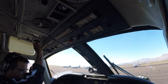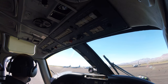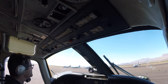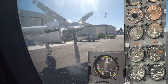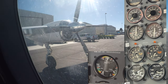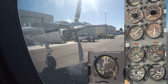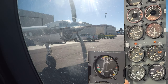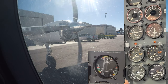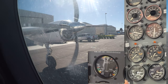We can now bring the generator online to recharge the battery and provide power for the number one engine start. We wait for the amp load on the number two generator to stabilize and lower to under 200 before starting the left engine. The process for the number one engine start is exactly the same. I've only seen a Garrett almost hot start once in five years, and luckily that was while I was still in training and my instructor was quick enough to pull the condition lever before it overtemped. The ITT needle moves so fast it would certainly catch you by surprise. Treat starting engines like you treat takeoffs — assume the worst is going to happen and be spring-loaded to react. It is when you become complacent that you'll burn an engine up.